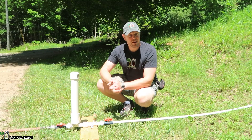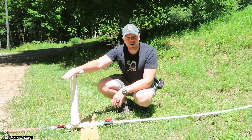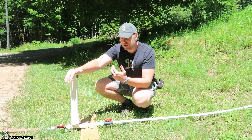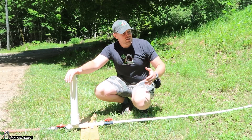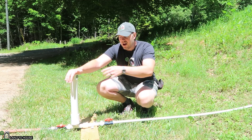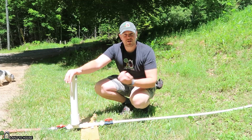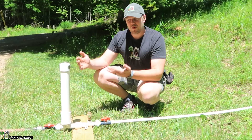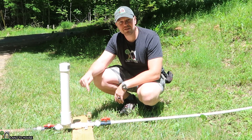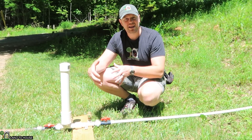I install a bunch of these and it takes me forever to prime the system. Water that fills up this pressure tank has to have back pressure on it to keep the pump going, and that back pressure is just the delivery pipe going up a hill with water pushing back down by gravity. If you don't have that back pressure, the water just squirts out and the pump shuts off. To prime the ram pump you have to put your delivery pipe up the hill and press the waste valve until enough water goes up that pipe and pushes back down on the pump.